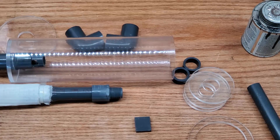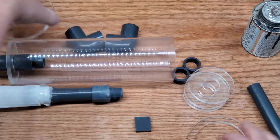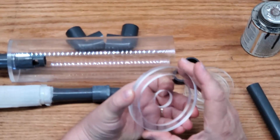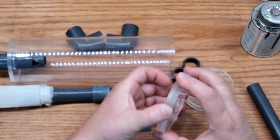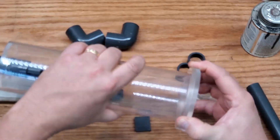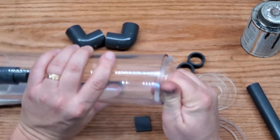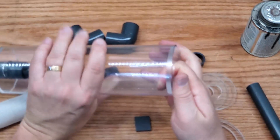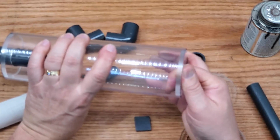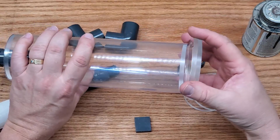So I need to deflect the flow — I need the flow to go to the sides first. That little piece of PVC pipe you see there with the hole drilled in it, that's going to get capped by the little square PVC you see there. And one of the reasons why you're not going to see this done today is my PVC glue is pretty much dried out now, and I don't have any acetone to loosen it up to make it a viable weld. So that is going to get glued on there, and I'll turn that down in the lathe, and that'll keep the water from shooting straight up. It'll keep it in more of a swirly pattern, and then hopefully that will end up allowing the diatom powder to populate the entire area of the screen, not just one end.